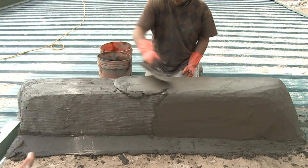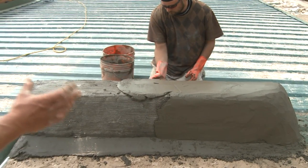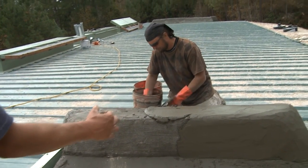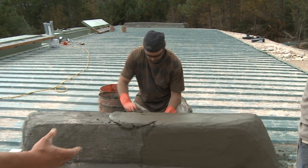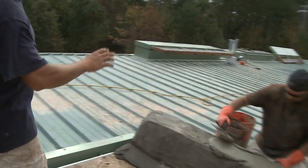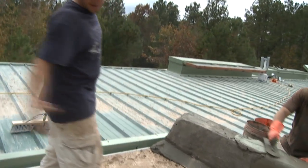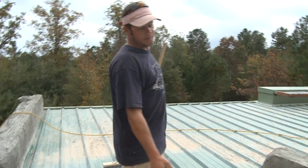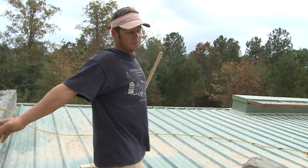They're just can walls that come up along the side of the building. They're insulated. It closes off the end walls and closes off the gaps in the building that would otherwise exist. And then there's a plastic vapor barrier that runs along the whole back of the building — it comes out about ten feet. That catches any water that percolates through the sand and runs it away from the building, and it's also captured by the parapet wall.